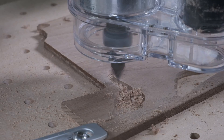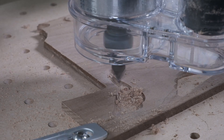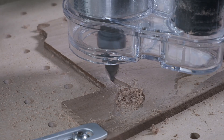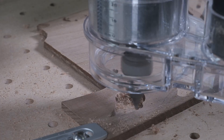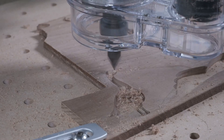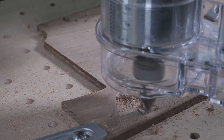Because it's crucial that the square endmill and the V-bit cut to exactly the same depth to prevent a mismatched floor in the pocketed area, and the toolpaths cannot be decoupled in Carbide Create, this workflow is currently BitSetter only. However, an advanced V-carve without pocketing enabled can still be exported just fine and run on stock machines.